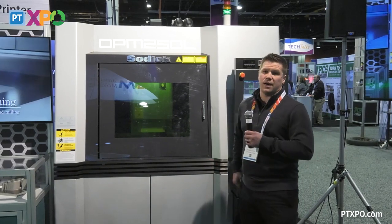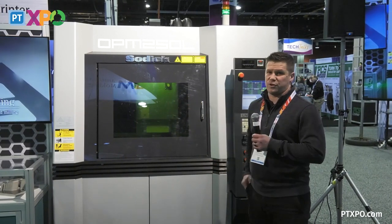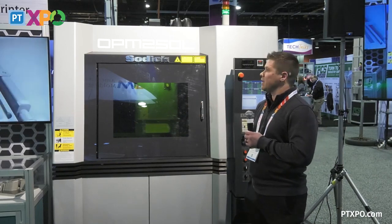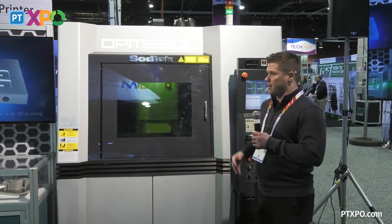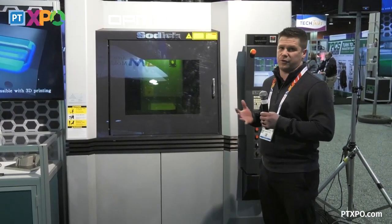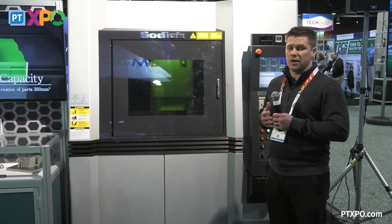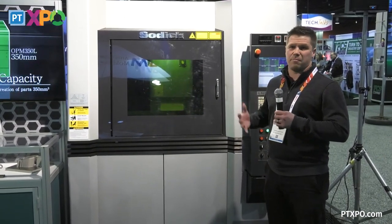Biggest benefit that we see, especially working with Plustek and Flowcon, which we've created this core cavity here, is that you're able to incorporate 3D conformal cooling into your builds now. So that's going to help reduce a lot of cycle time, help with a lot of that money management and stuff.